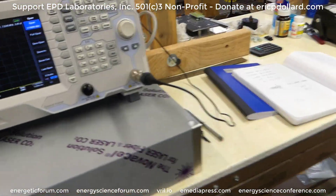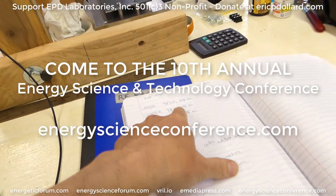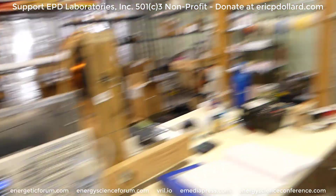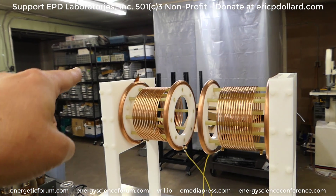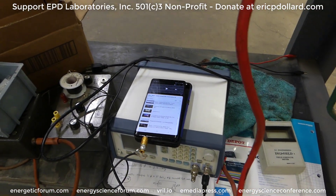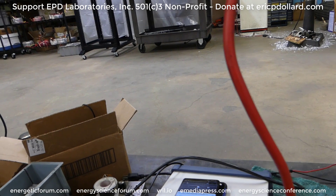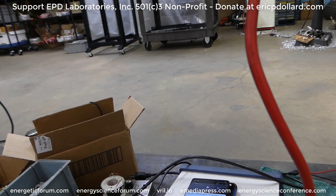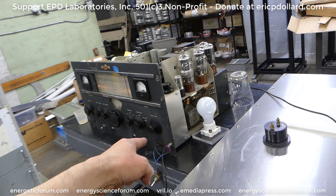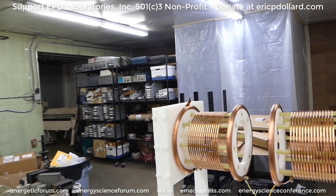We're fine-tuning things. We've got the spectrum analyzer set so that the frequency of 7.824 MHz or so is pretty close to the peak and the amplitude comes about 90% of the screen. With the triangle piece of metal coming to a point, that'll have a little flame. I have the cell phone playing Bach Violin Sonata No. 1 in G minor — a fairly constant violin sound without too many ups and downs, because big changes would over-modulate and put it out. That's going to the microphone. This flame is about four times bigger than the little flame speaker.